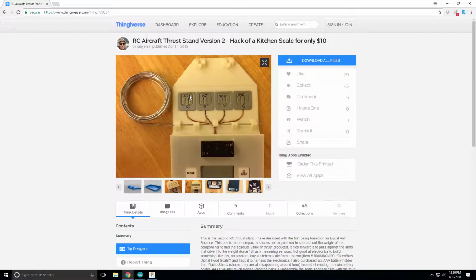I can't exactly remember. I sort of know how they work. I just use them, but I sort of know how they work, so I'm going to explain it. When they flex, the resistance increases, and because you're pushing voltage through it, you could read the current change or the voltage change. You feed a constant amount of current through, and then read the voltage change, the voltage drop through the sensor. So that is the way that it's done.